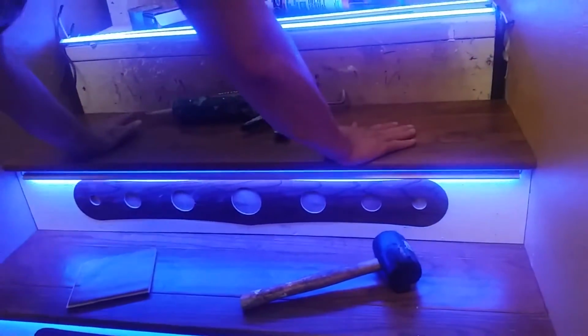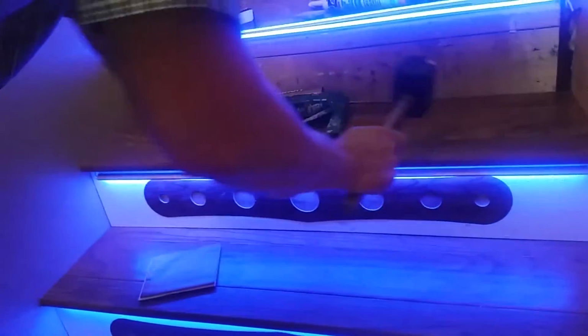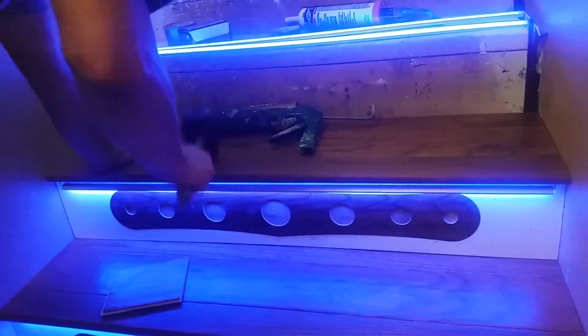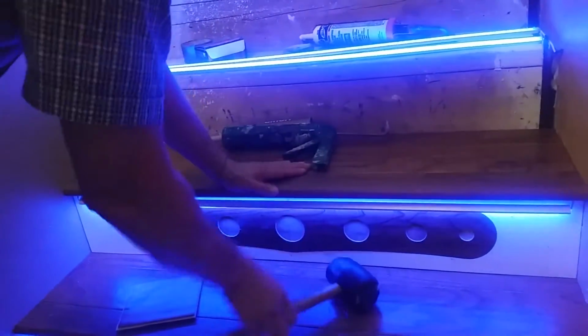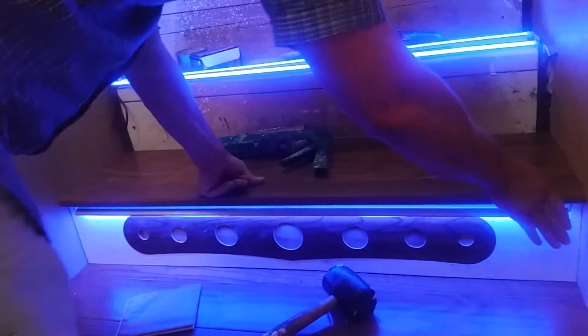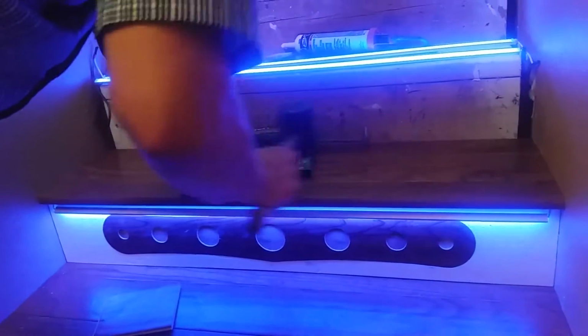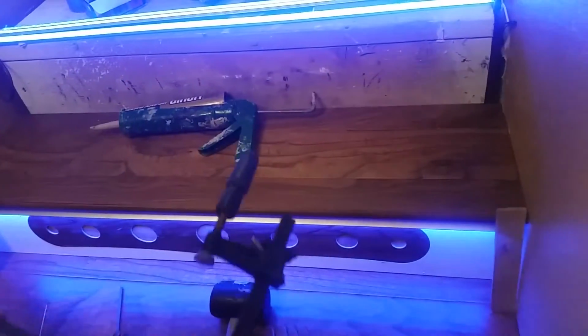Okay, now that baby. I just need to pound on this. I feel a little bit of a gap there, and I'm gonna fix it with a nail, but also to make sure that this is nice and tight here, what I do is I use some clamps, and this is why this process takes so long, because I kind of gotta let this glue dry, and I'm gonna put these clamps at either end to clamp this thing in place, to hold it nice and tight and snug.